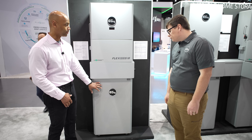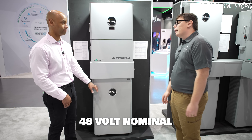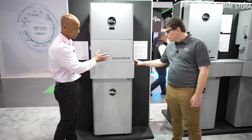And of course this is a 48-volt nominal, right? Yes, 48-volt nominal. Lithium is like 51.2, but yeah, 48. All right, let's talk about the conduit box — how does this help if you're going to interface the battery to, let's say, the Flex Boss inverter here?